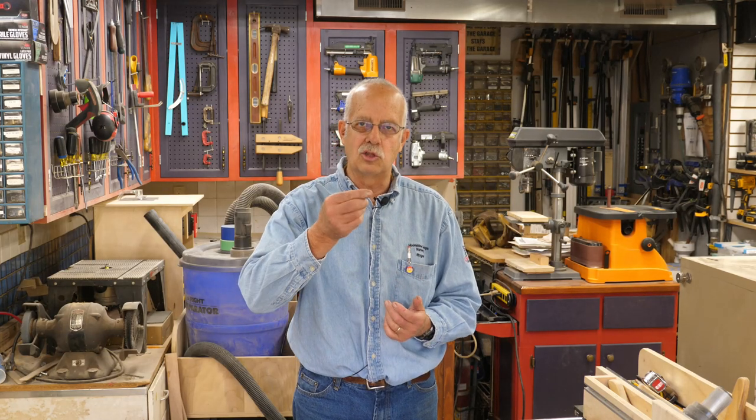So what I'm going to be doing is ripping down 2x8s, 2x10s, and 2x12s to make the necessary Douglas fir parts I need. Because those little edges where I rip will need to be rounded, they'll have to be run through the router table with an 1/8-inch roundover bit. So yeah, it's a little bit complex, but we'll get through it here. It's not impossible. Later on in the video, you'll see where this is. I'll be doing it here in a couple days.